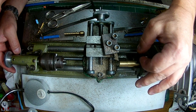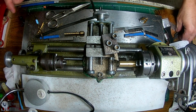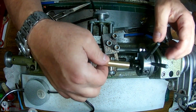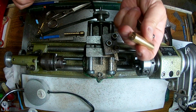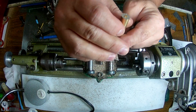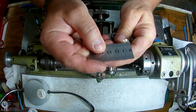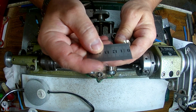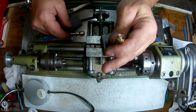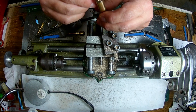We're getting close to the edge, but it will require me to remove a bit too much material. Let's see where we're at now. You can actually see the hole is still not exactly centered. Taking my ruler, I've got still like 3-4mm over here and almost 4mm over here.